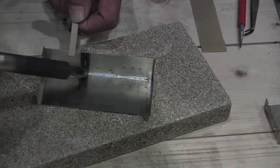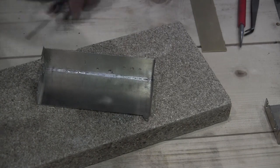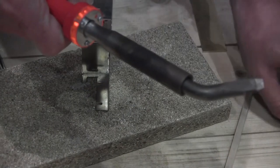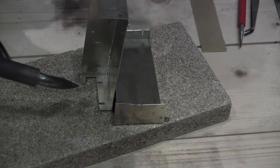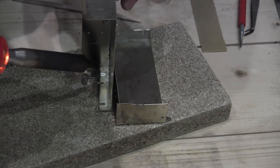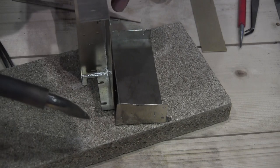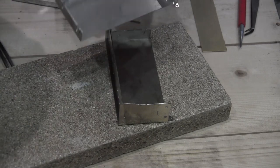And you can see that by using an iron with a nice big bit on it, there's never a problem with getting enough heat onto the job. So to do the corners then, quick bit of flux, bit more solder, and again. What I'm doing is pushing down here to get that piece into the slot and held there. Okay, and there we go.